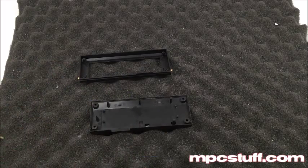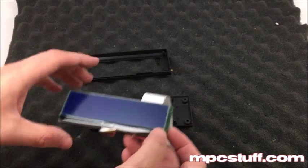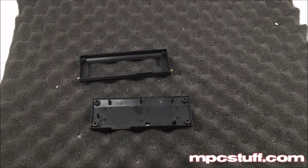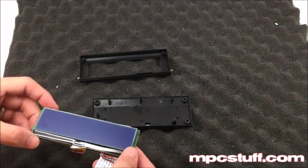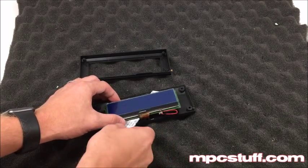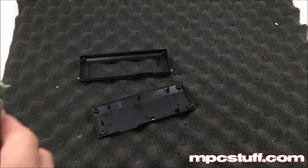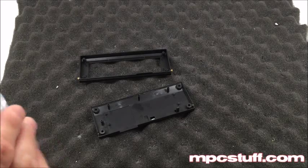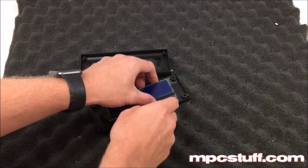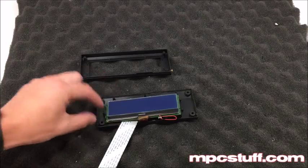So then you have your cord here that's going to come out. And this, you'll see, is going to go on just like the same. You have these two on each side. This side they're solid, so make sure you do the left side first when you're adding the screws. You have to bend the LCD wire a little bit, because the way it is, we've used them so they can work both with the 2000 and 2000 XL. So the cable is going to have to kind of move over here. The cable can be bent — just don't bend it too much. So we'll get the cable coming out, set up our cable, put that in here. And now we're going to go ahead, once we have our LCD in here with the part sticking out here, we're going to go ahead and put our screws in.